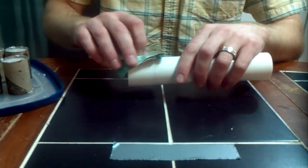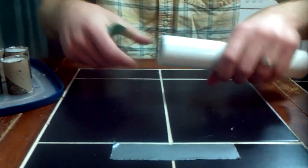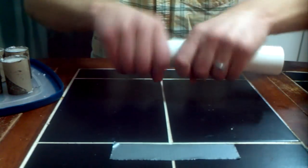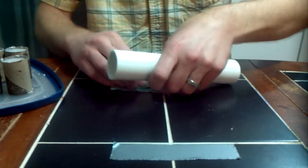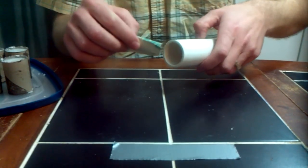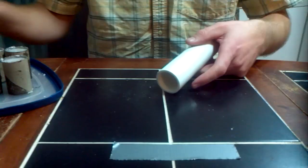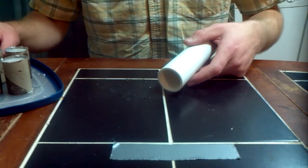What I've done is I've cut this at 8 and a quarter inches. What you'll want to do is scuff up the front and lower part of your motor casing — I've already done that in preparation. Roll up your sandpaper a little bit and bevel that inside edge. That just helps so that your Bates grains go in there with relative ease, as opposed to meeting a jagged edge and stopping. The ideal situation is that these will fit in snugly.